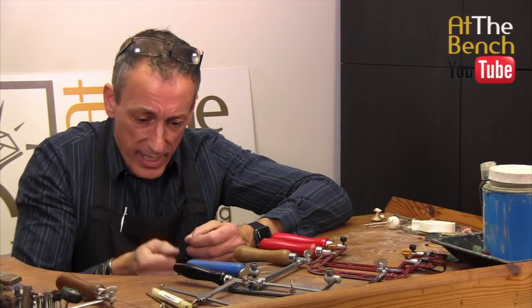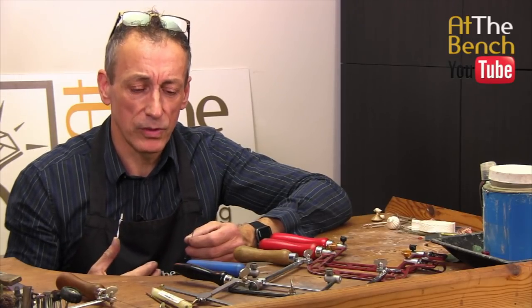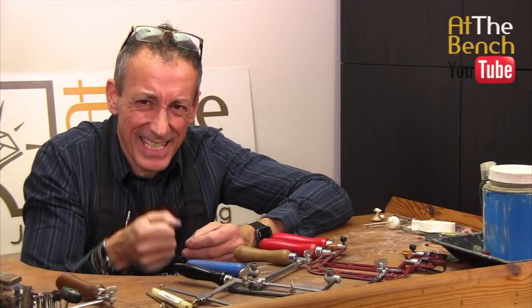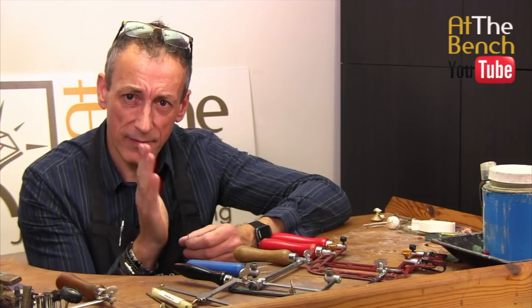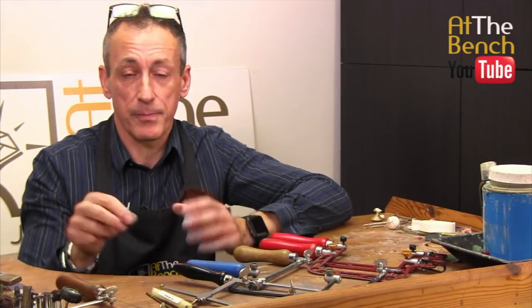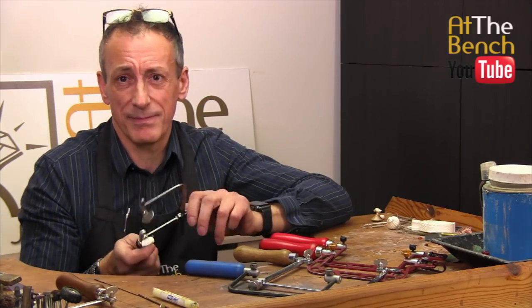Also, the shorter the blade, the quicker you have to keep moving your hand up and down. I like to have a long stroke using the full length of the blade. If the blade is six inches, I want to use six inches and have a nice rhythmical sawing action. With a short blade, the cut is not going to be lovely and smooth — you end up doing short rapid strokes. I don't like it. My preference: the adjustable frame is a no-no for me. It's a fantastic idea and loads of people love these frames, but because this area sticks into the side of my hand when sawing, it's not an option for me.